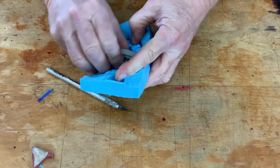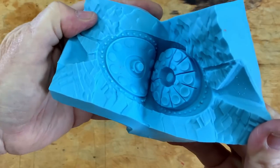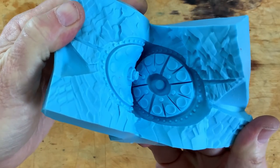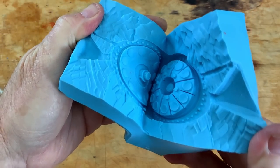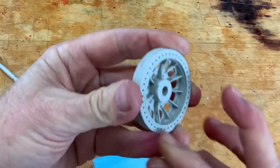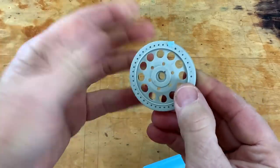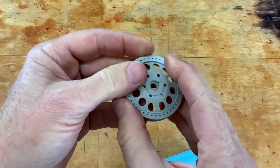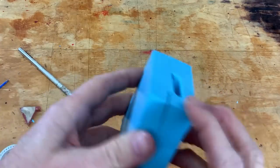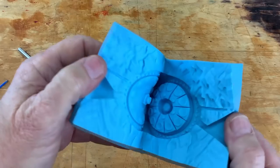Let's see if we can pop this out now. Look at the tiny little holes on both sides of the mold — look at that ring of holes. So that backing method worked really well on this particular mold. I'm reasonably certain this is solid without fill, just a solid hunk of plastic. But lots of times your model is going to have hidden holes and voids inside, and if you put them under vacuum or pressure you are going to destroy the model and make a mold of a destroyed model.